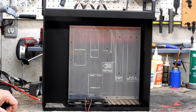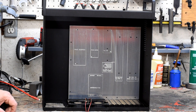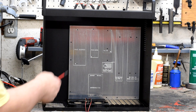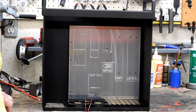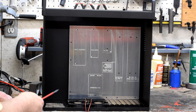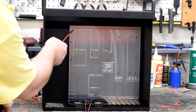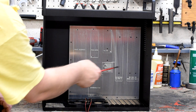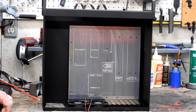I've gone ahead and taken the drive cages out. There's lots of room in here, and each one of these places shows where the components are going to fit in the final design. We've got lots of space — we could actually expand this to fit another axis if we wanted. I've cut this plate on the X-Carve. The X-Carve cut all the holes for the mounting bolts and engraved these profiles along with some call-outs for the threads that I had to do to make it all fit.